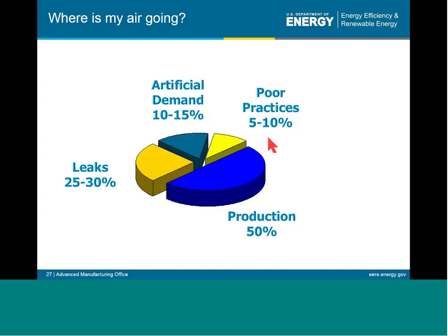There's over 1,000 CFM. That's over 200 horsepower just to mix the ink. Quick shot online to the same company, and lo and behold, they make electric conversions for all those ink tanks. It's all water-based ink. Years ago it wasn't. Today it is. And each one's 1/8 of a horsepower, fractional horsepower. So there's about a 700 horsepower, actually almost 800 savings.